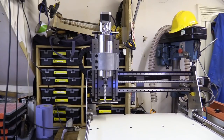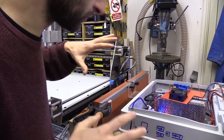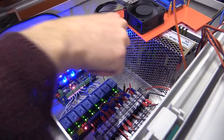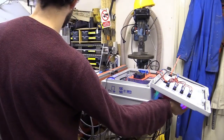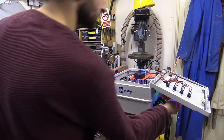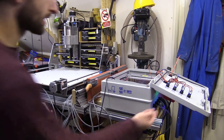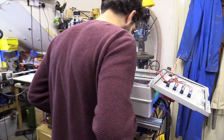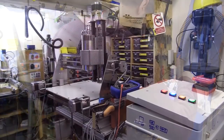I ran into a little trouble getting the machine moving, but it turned out to be something very simple. I've got it moving — it was the hard reset which was wired into the normally open terminals on the relay. I also miswired the resume start button which should have gone to the normally open terminals on the rear of the switch; I just didn't pay attention to my notes, but it was a quick fix.